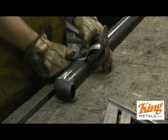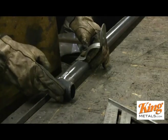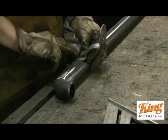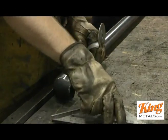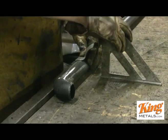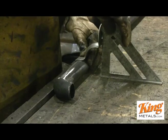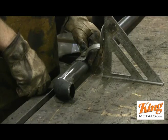I've already marked my spot and I'm going to put the bracket there. I want to make sure the 90-degree angle is flat. This depends on how you want it to go — if you want the curve to face the wall, make sure it's flat. If you want it facing down for any reason, you'd turn it straight up. I'm going to place my bracket where I want it, hold it in place, then take my speed square, put it on the table, slide it up to the center of the bracket, and make sure everything is flush at a 90-degree angle.